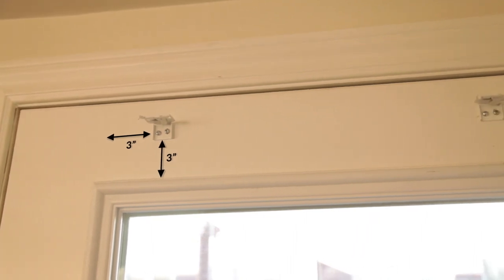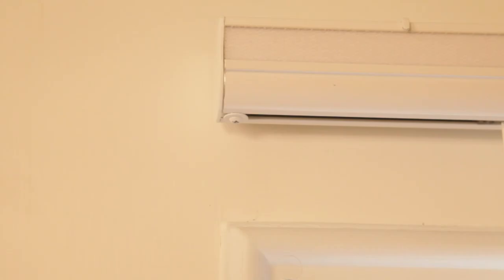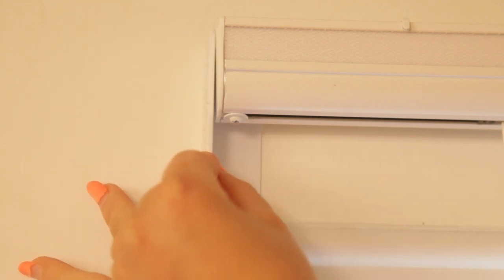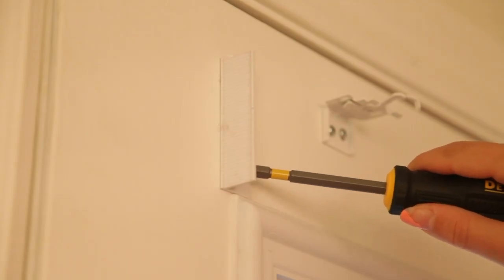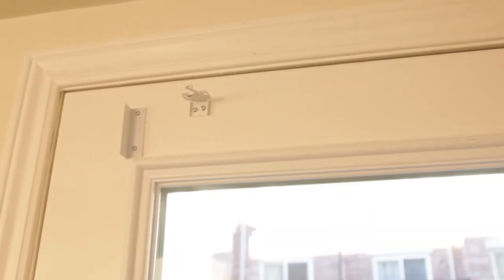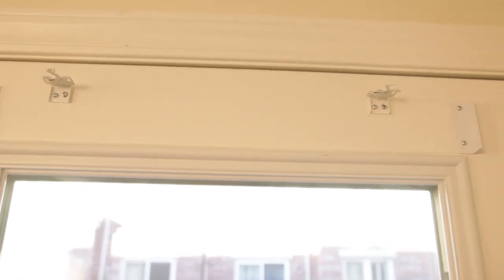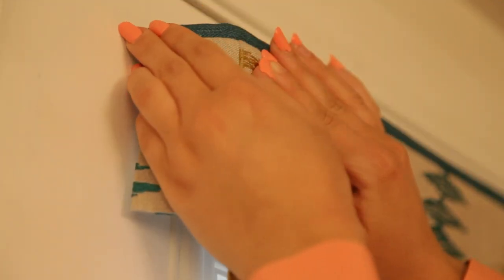Similarly to the inside installation, we need to install two brackets on the surface of the door or the wall. Now that the brackets are installed, the next step is to install the returns. The purpose of the returns is to hide the sides of the mechanism from view. In order to see where to place the returns, we must first hang up the Roman shade. Place the return against the mechanism and leave a little bit of space between them, then mark with a pencil where the return should go. Next, remove the mechanism and Roman shade and install the returns. Now that the returns are attached, we can put the Roman shade back, this time attaching the sides to the return at a 90 degree angle, perfectly hiding the mechanism.